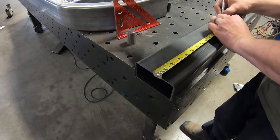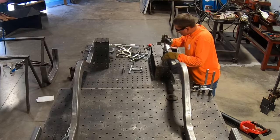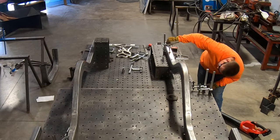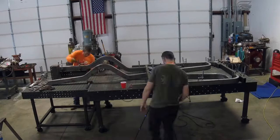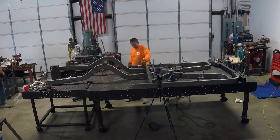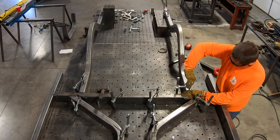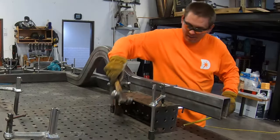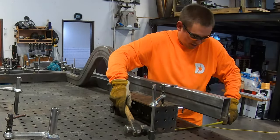While I cut the next pieces of the assembly, Dave got those rails roughed in place. This might actually be the most difficult part of the whole deal. See, you've got to set a 5-foot long stick of tubing perfectly flat and parallel while hanging loose in the air. The fixture blocks help a ton and work with the same stops and clamps we've been using up to this point. Still, I'm just trying to get this close to make sure that end is right.